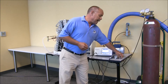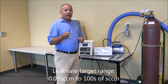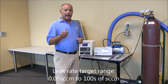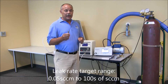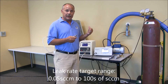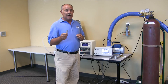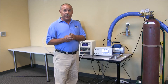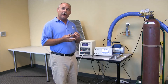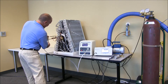To simulate a leak into this product I have a 200cc per minute leak. That's a large leak — I would consider that a gross leak. That is the type of leak that can be detected with a quick vacuum or pressure decay typically used for this type of process. At 200cc per minute nitrogen with one atmosphere differential, that's thousands of ounces per year. So once again, this is a leak detectable with a pressure decay, vacuum decay, or mass flow technique. I'm going to plug the leak into the test line.